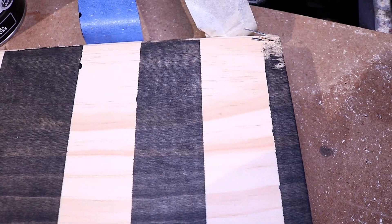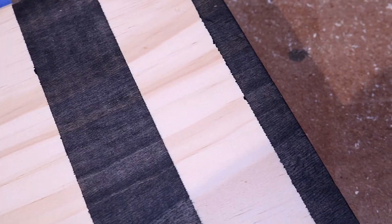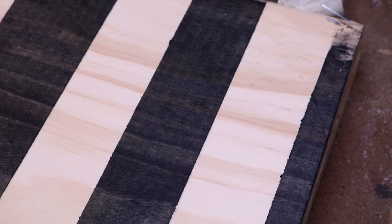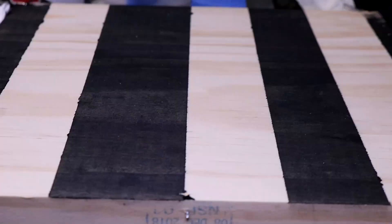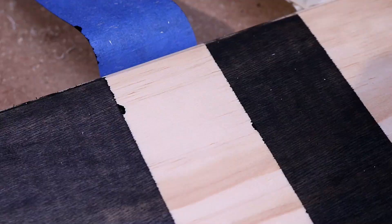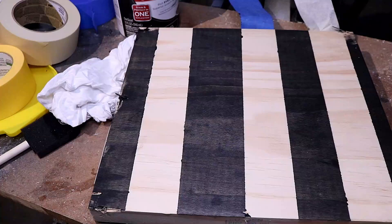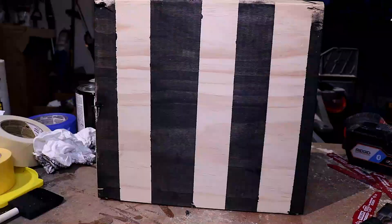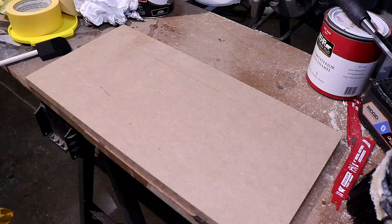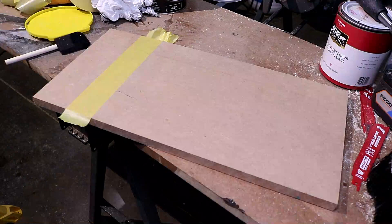The 3M generic contractor tape that only costs around $3.20 actually looks like it did a better job — you do have some bleed over but not as bad as the FrogTape. You could definitely see stain seeping in more on the FrogTape even while the tape was still on. The 3M Blue did a lot better — definitely a lot cleaner on top. There are a couple spots that bled over but overall a cleaner line. So right now the 3M Blue wins, the FrogTape did the worst, and the contractor gray for three dollars really didn't do that bad.